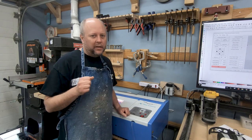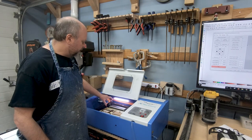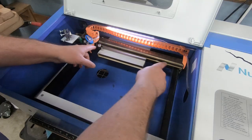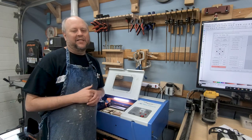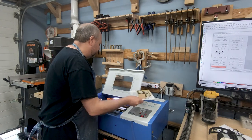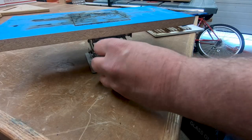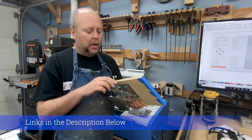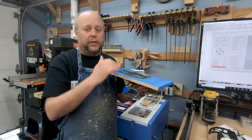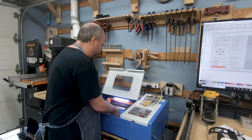As you start working with it you'll quickly discover some major shortcomings. The very first is the bed — there's a very small cutting area with the bed included with the K40. By removing that bed you get a lot more space and can work with different thicknesses of material. So that's probably the first thing you'll want to replace. The way I did mine is I got one of these scissor jacks — called lab jacks, used for Bunsen burners and beakers — you can find them on Amazon really cheap. It's a great way to raise and lower your cutting surface. A little double-stick tape with a piece of scrap wood and I can raise and lower the platform as needed.